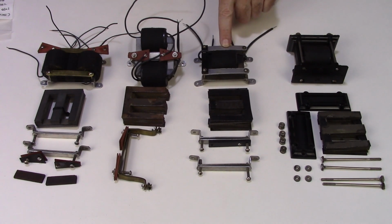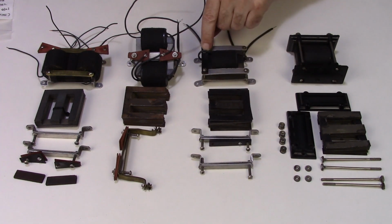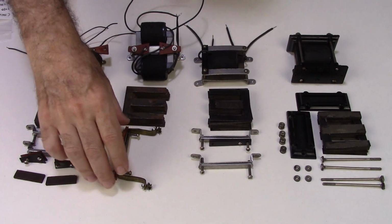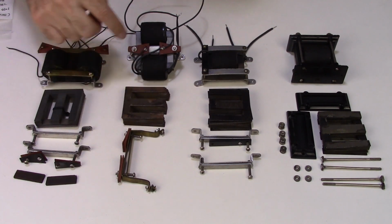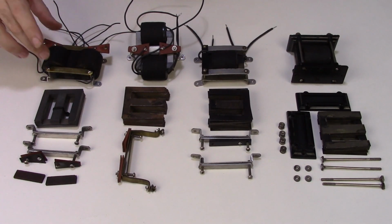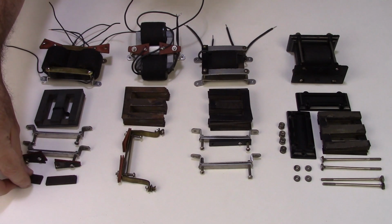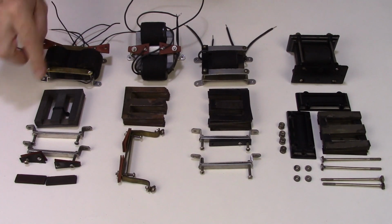You've got the single bracket, which has a bakelite, one connection in the center here, well, kind of off center here. And then you have the dual transformers here for the Model 130 and the metal version of the Super 5, and that has a single bracket like that goes down the center here to create the 2 connection points. And then you have the one that's used in the Super 5 versions that have the 2 side connectors, which are basically the same bracket, only shorter. And this one here has the spacers. Actually, this one should have it, but these wooden spacers here help to keep these dual transformers from moving around.